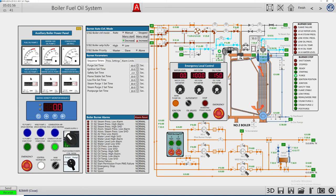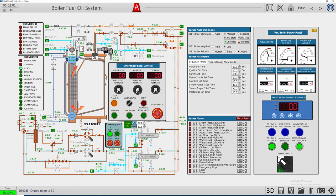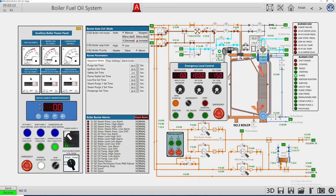We must verify that all valves have been changed over correctly to the fuel position and none are in the wrong position. This is really important — we are 100% sure that diesel is not going to fuel and fuel is not going to diesel. There is a lot of fuel mixing that can happen, and we do not want any mixing of fuels because the sulfur regulations are really strict. We have a flame — low firing.